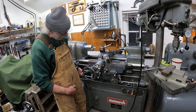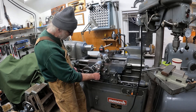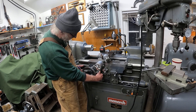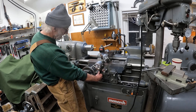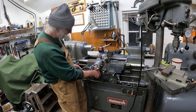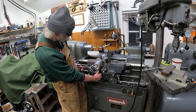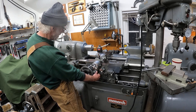When it kind of bounces like that, it needs a little more oil. So you just engage it, disengage it, and get it so it just slips. This one's getting a little stubborn — I think I'm engaging a little hard. You want to let go of it. You don't want them to be too grabby. This one is acting a little bit grabby. It takes a while for them to oil up — that's doing good, I felt that oil on the tunnel.